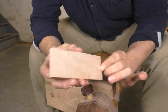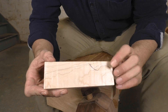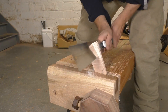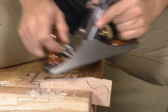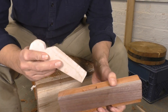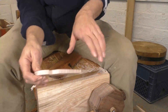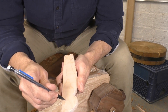Now I've got a nice piece of maple that's already the right thickness, and I've laid out a wedge in pencil. I've got good details for the wedge in the plans, but you can also just draw these freehand — they are not complicated. I'll do most of the shaping with my Ryoba saw and a plane, and I'll cut the curves with a coping saw. When my wedge is roughed out, it's exactly what I want: a nice tight fit and way too big. I like to leave lots of extra material on my wedges and slowly dial them in for a correct fit.